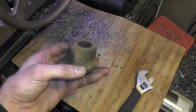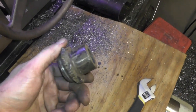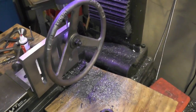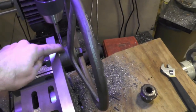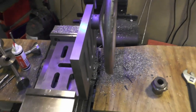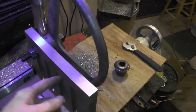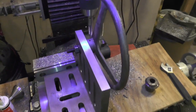Here's what's left of the wheel for the left side of the arbor press, used to wheel the ram up and down. A number of years ago they were throwing out this cast iron wheel, roughly 12 inches in diameter, at work. It had two holes pre-drilled into it, one on this side and one 180 degrees around. It didn't have any way of holding it so I set up this right angle plate. I made a bushing that sits on the ID of the slots and then the ID of the wheel itself. Right now I'm just getting ready to tap it out.